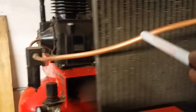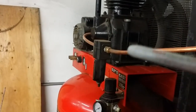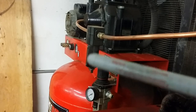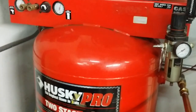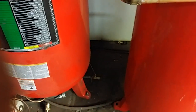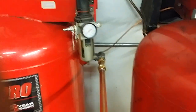I have a valve at the bottom that I can throw and plumb into my sink, so once or twice a day depending on how busy I am, I'll drain this filter out. Off the top, this copper line comes out and goes into one more water filter with an automatic drain, then into the first storage tank. At that point I have fairly dry air — after one or two days of heavy cutting, when I drain off the bottom, I'll get maybe an ounce of water.